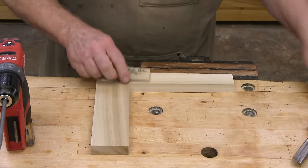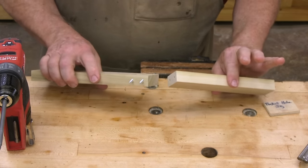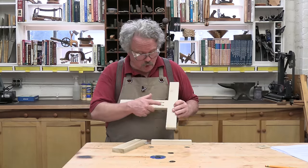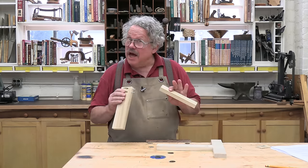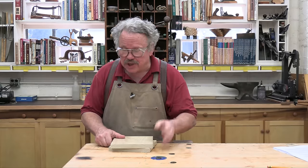Over-tightening the screw or putting some stress on the joint can easily strip out the hole, and the screw will come loose. Long story short, unless there's an incredibly good reason not to do so, you always want to drive the screws into the face grain of the joined board, not the end grain. And you should pay attention to the grain direction.